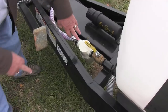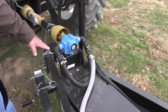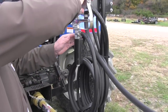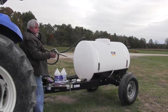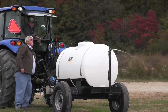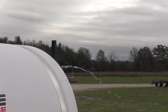It's got to go through the filter. It comes out of the tank, into this brass fitting — and brass will freeze and bust — so we want antifreeze in there. We also want it in this plastic filter system, then on to the pump. Once it leaves the pump, it goes up into the control panel. Then we pull the hang gun and get antifreeze through that as well. Finally, we turn on the back boomless nozzles and get it through those too. Once we do all that, our system is winterized and ready to go through the winter. We'll talk next spring about what to do when you take it out of hibernation.